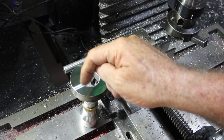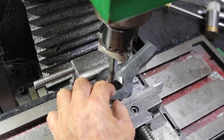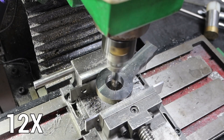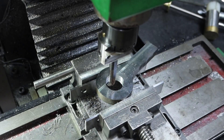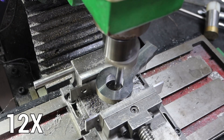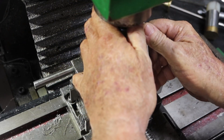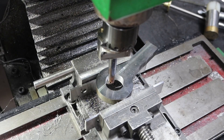I'll get that out of there and move it up, then we'll do something about putting the boring head in and boring this out. I'll spend a bit of time setting this up this morning - time to bore it out. It's only 30mm and it's got to go out to 40, I might even go to 41. I've got a 0.2 radius tip in there because they cut a bit better, but don't leave a good finish. When I get to the end I might put in a 0.4 or 0.8 radius tip to get a nice finish.